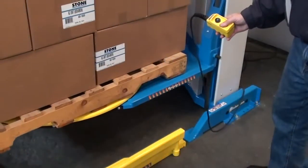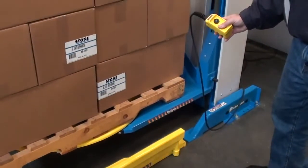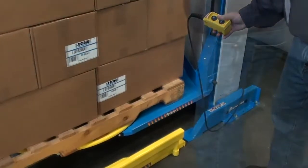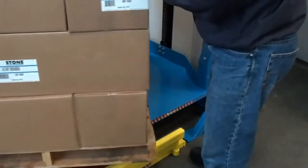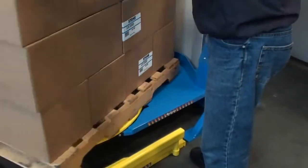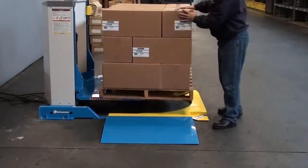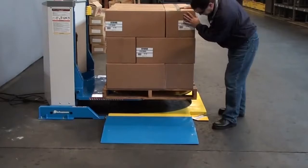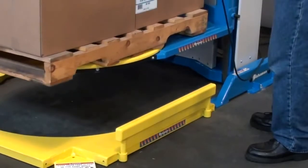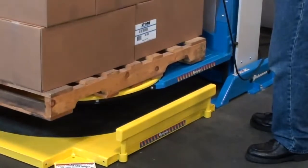The patented feet clear circuit protector stops the downward travel of the platform at nine inches above the floor and several inches above the base legs. This feature serves three purposes. First, it enables full rotation of the pallet for completion of the load. Secondly, it allows the pallet to be set to the home position for pallet truck fork access before lowering to the floor level. Thirdly, stopping the platform at nine inches above the floor prevents unintentional foot entrapment under the platform or pallet.